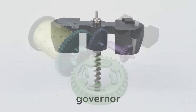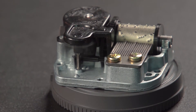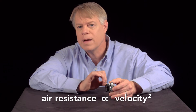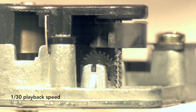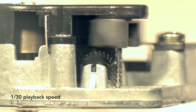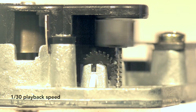It's connected to the drum by a gear train. The gear train is compactly built into the music box. The rotation of the governor controls the speed. Stop the governor, and the drum stops. The governor uses air resistance to control the release of the energy from the spring. Air resistance is proportional to the velocity squared of the object. When started from rest, the governor encounters little resistance and speeds up readily. But when it spins rapidly, over 3,000 revolutions per minute, air resistance swiftly increases, which prevents it from moving much faster. This action limits the speed of the governor, and limits the rotational speed of the drum.